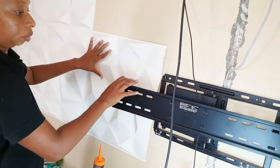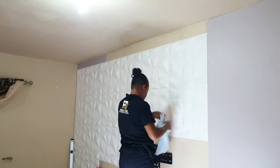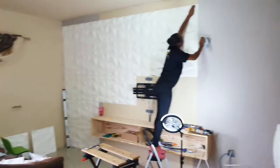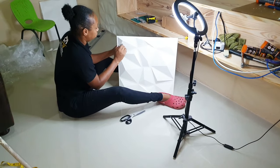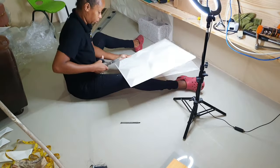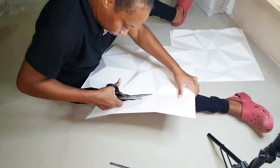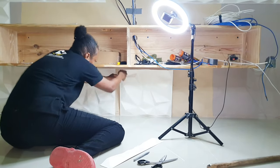I'm going to speed up the video now, but first let me tell you some of the tools I use: a tape measure, a level, pencil, a silicone gun, and you definitely need a bucket of water, a putty knife, and some fine sandpaper. You also need a lot of old towels or old rags for cleanup, because I cannot let the glue dry on the surface. The good thing about the Gorilla Construction Glue is that it becomes tacky in two to three minutes, so any excess on the front of the tile can just be peeled off or rubbed off with a dry cloth.